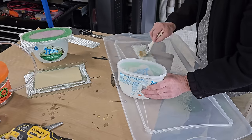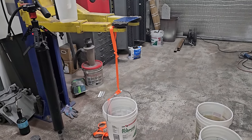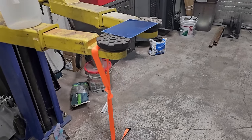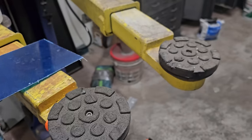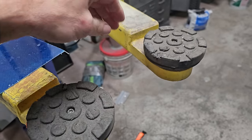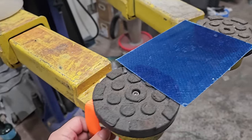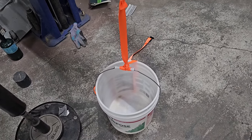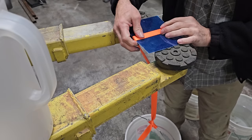The final sample steps away from three layers as a comparison piece: nine layers of unidirectional fabric. Here is our test rig. It's not unscientific - it's very scientific; it may not be super accurate but it will be accurate enough to show what we're trying to display. The sample goes between these two feet which keep the span distance the same across all samples. We put the sample between the supports, place a strap over it, fill a bucket with water - we know water weighs 8.3 pounds per gallon - so we'll know the load when it fails.